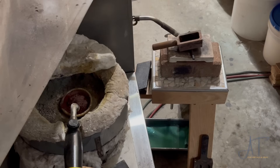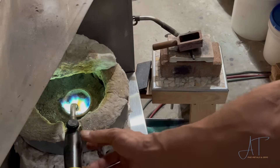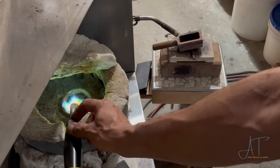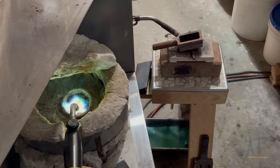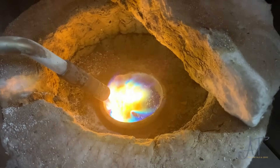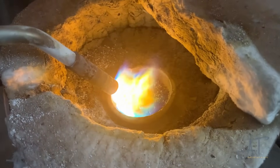I've loaded up an ounce of material into a melt dish — I've used this melt dish a couple of times only to melt pure copper. For this test we really want to see how our flux and our metal come out so we can test this in the XRF. I'll gently heat all of the material in the dish, and as the material turns red I'll slowly turn up the gas.